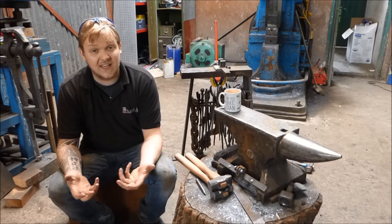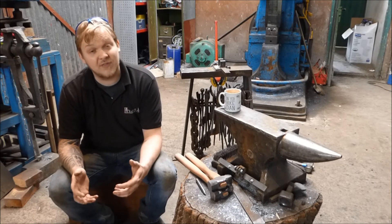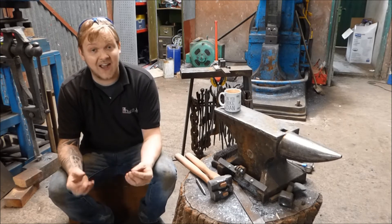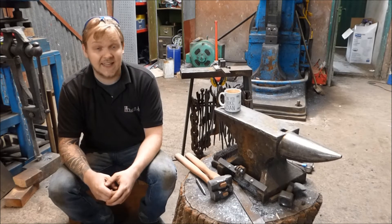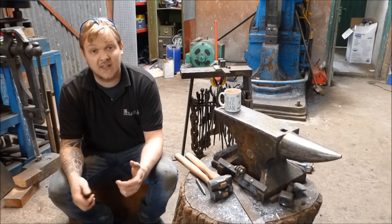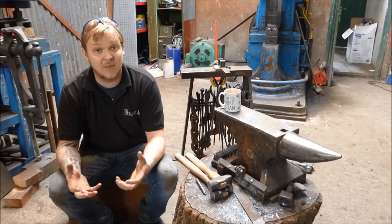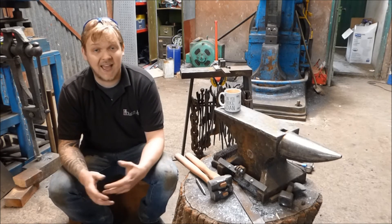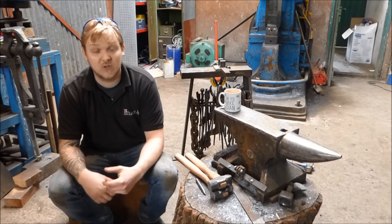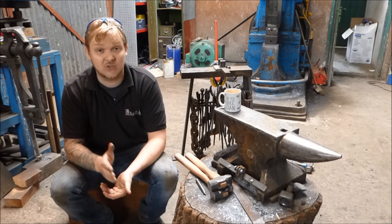So what is the critical temperature? It is when the steel is raised above 723 degrees Celsius, or 1335 degrees Fahrenheit. When steel passes this temperature there is an actual chemical change in the material — it goes from being pearlite to austenite. When the crystal structure changes to austenite the properties of the steel also change: the steel becomes non-magnetic, it doesn't rust, and it has a property whereby you can dissolve new materials into it — what we call an alloying property — allowing us to add alloys of ferrous materials to the bar.